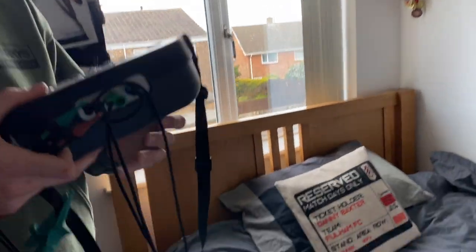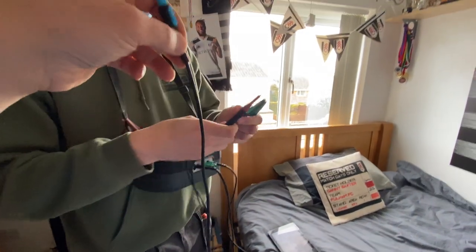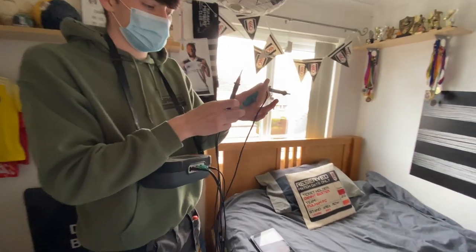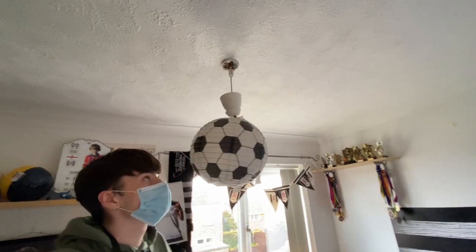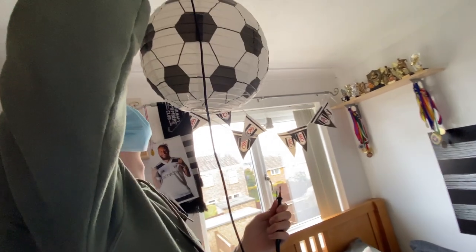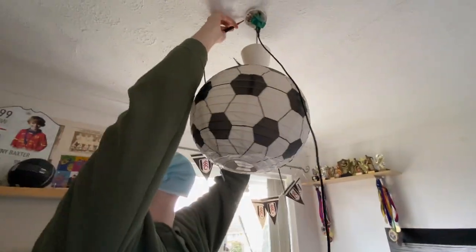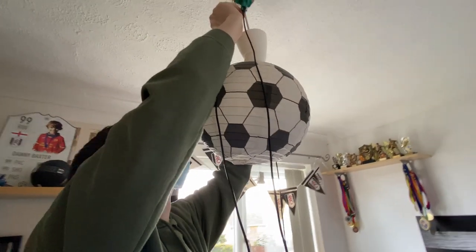No trip. We tried to conduct a Zs on the downstairs lighting circuit and the tester said EFLT - Earth Fault Loop Test - which means the earth fault loop path is exceeding the high resistance threshold. So we're going to just hope we can get a reading off of here. I'll get it on camera because it might bring up the same fault. Put the croc clip on that earth, then the two probes. Red one in the middle, then we do the switch line after.